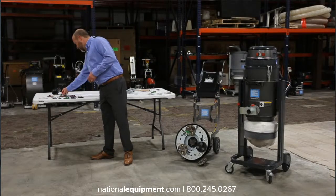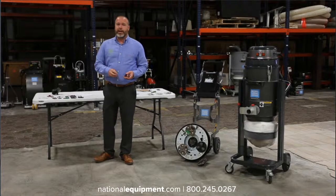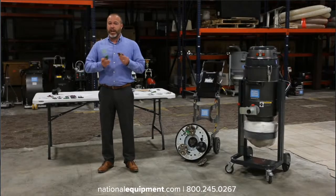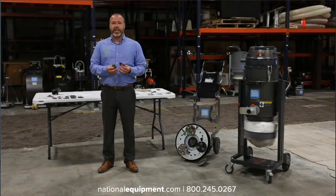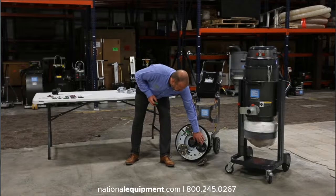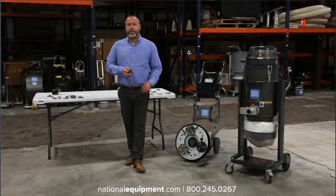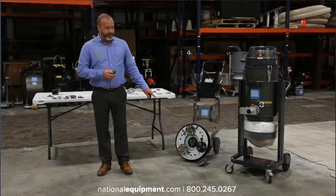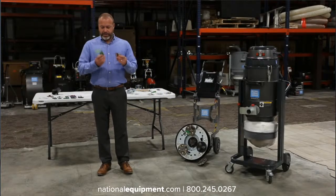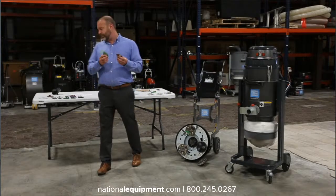You can also use diamonds, again talking about just other options. If the job doesn't justify the price of carbide chips or PCDs, our scarifier cutting head is a little more expensive up front, but the life of that is phenomenal. Even if it doesn't justify that, your traditional diamonds are going to do just fine.